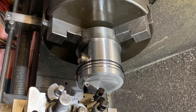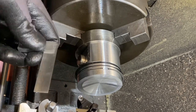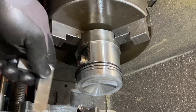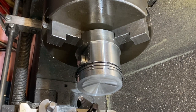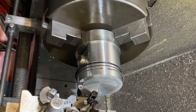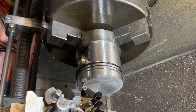So what we're now going to do is set up to machine the crown on the inside and dish it out more. The next thing I need to do is find out where the edge of my tool is versus the edge of the piston. I'll use a simple square to bring the tool up to the piston edge when it touches — that's good enough. That's so I can reference the dish to the edge so I don't overcut. I zero my machine and I now know where that edge is so I can put that in on the DRO. So first I'm going to put a 100 thou deep dish in, then take the piston off and go over to the burette to see where we are. I've already calculated using the spreadsheet, which I'll talk about a little later.